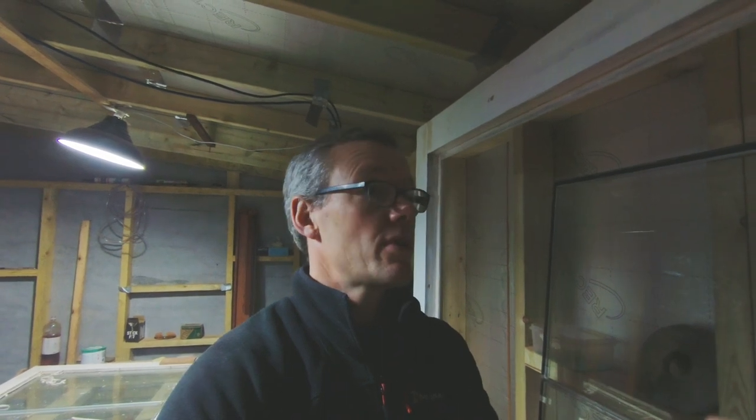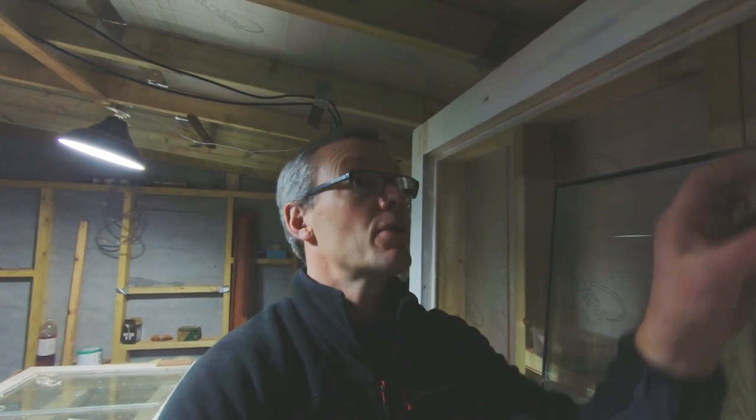I think that's where I'm going to stop for Christmas. This door is now sanded, prepped, all filled, ready to paint. We're going to paint it black — it's a primer, undercoat and top coat. Then put the glass back in with some mastic and then put a beading — wood bead all the way around the edge with mastic, silicon, whatever you want to call it.